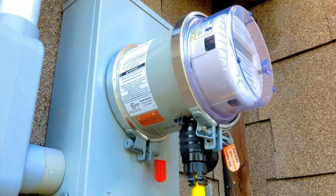This can also work with an oil burning furnace as long as it's a 110 volt application and not 220. There's many other ways that you can get power to your home, such as a transfer switch, or there's a piece that mounts between your electrical meter and the home that's called a Generlink. And they're pretty spendy, but they take all of the brain work out of this, and you can plug in your power station or your generator into that Generlink and have power, and it automatically transfers from grid power to the generator if you don't have power coming in from the grid.